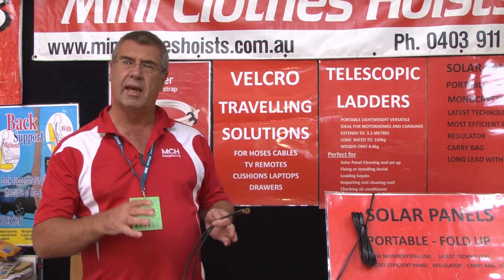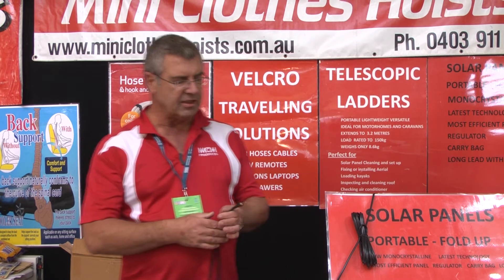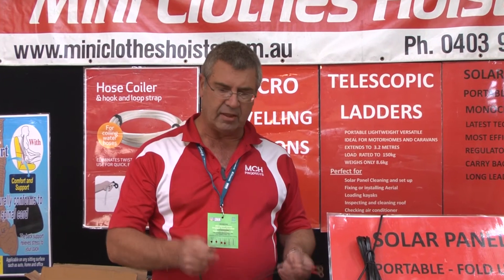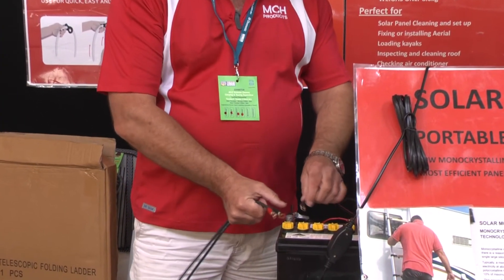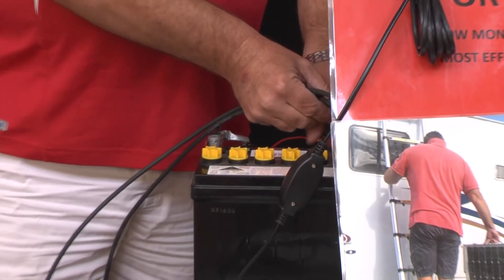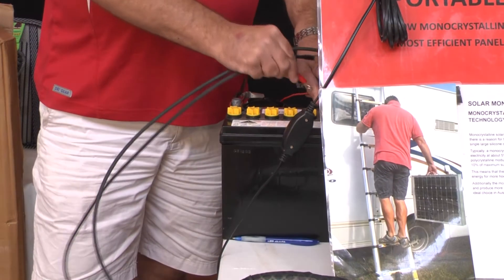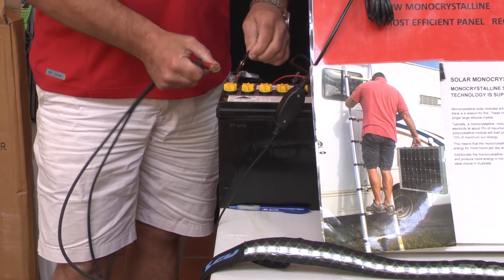You've also got to consider battery requirements — you'll probably need two batteries as a backup for days when it's overcast or raining, to cover you when you don't have sunlight. The process involves attaching your solar panel to the battery, then using clamps to draw power from it. You can see the clamps are supporting the LED lights here — if I take that off, the LED lights go off. So the solar panel is charging the battery and the battery is running the LED lights.